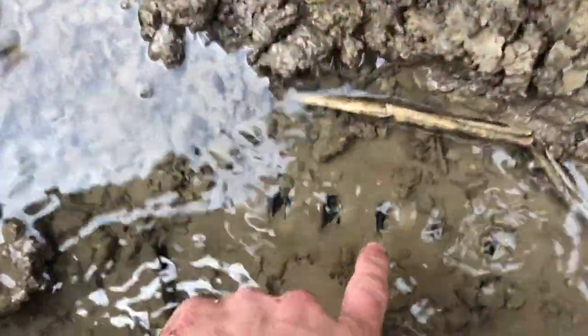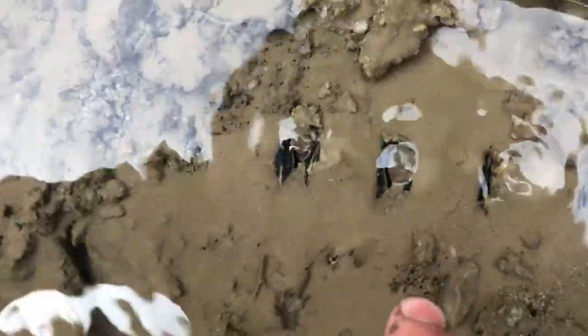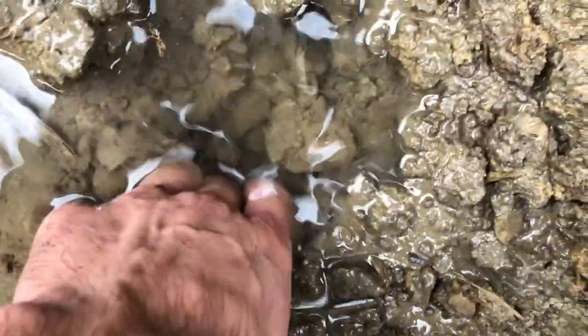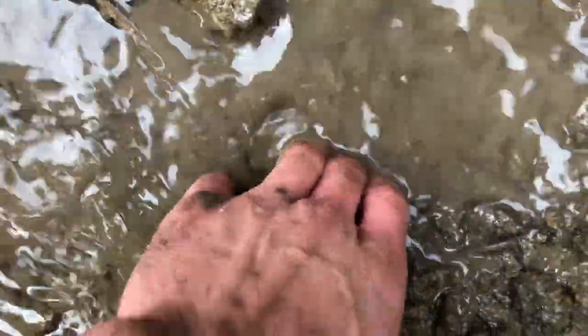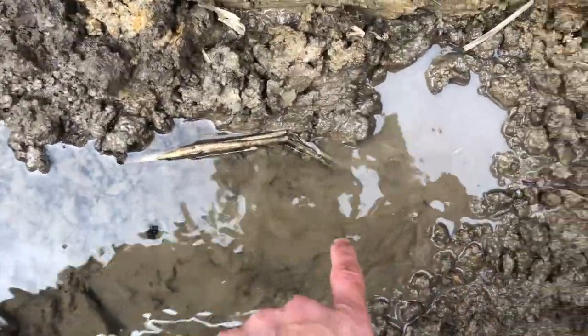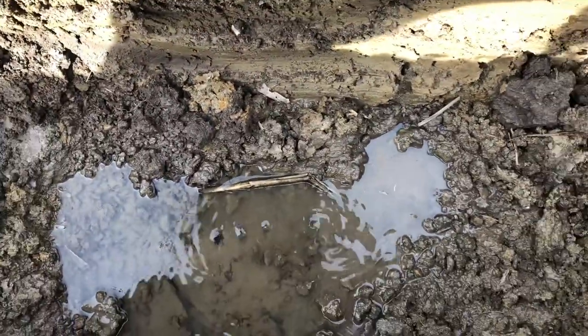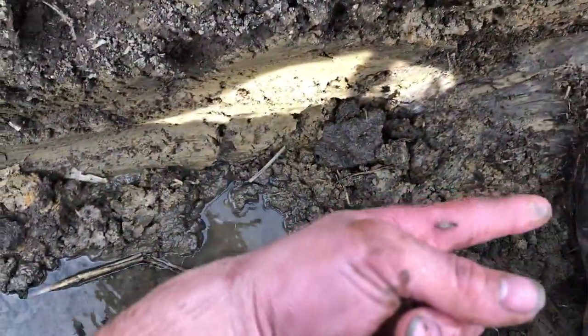You can see the top of the tile here — it's running right now. The water was very, very mucky, but you can see the hole in the tile right here. It's letting all the water in, so I'm gonna have to dig this up. You can see it running, going right for that hole. I've got to dig this up some more and go that way — it runs right to the ditch.